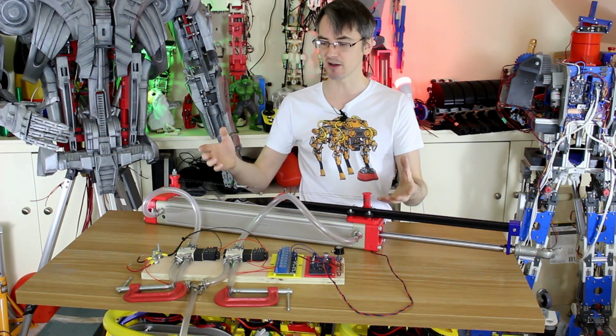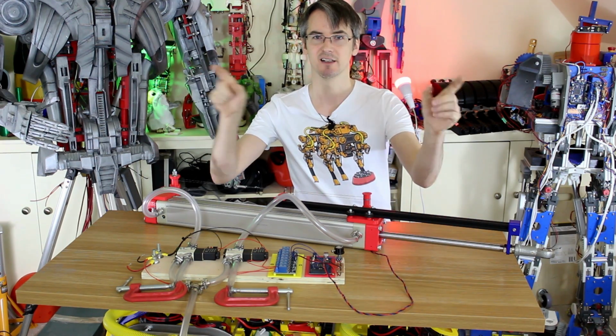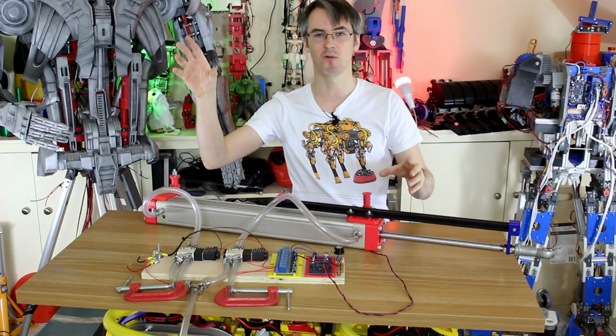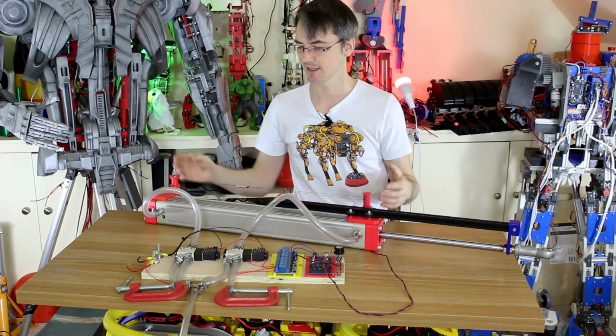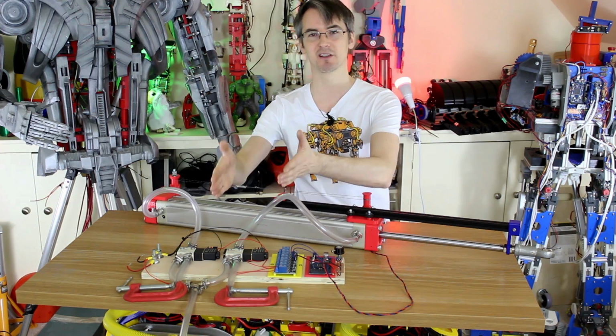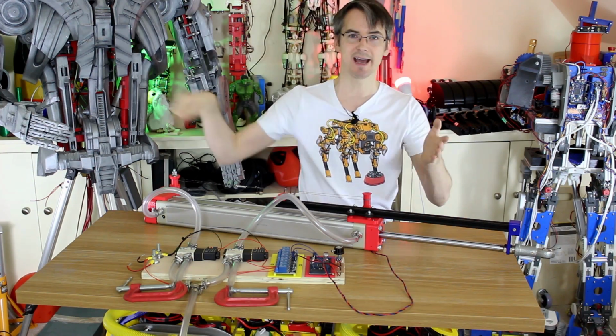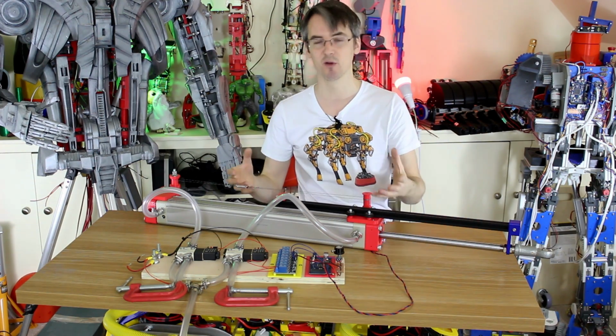So as I say, we could get a valve which has like that 3 position, so it's off in the middle, locking the air in, then it switches either way and that lets air out of one side and pushes it in the other side. And that's actually designed for controlling a cylinder like this. So we don't have one of those, so I could go back to 2 separate air sources. When I isolated those, of course, there was no way air could go back into the other side of the cylinder, so it held it fairly rigid.